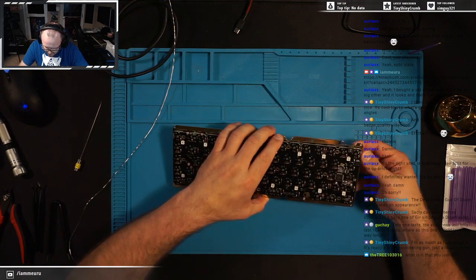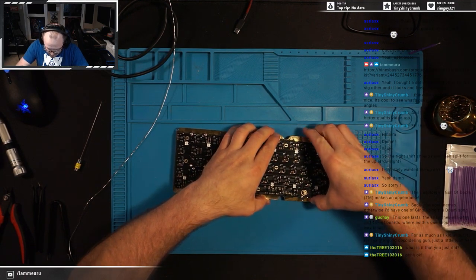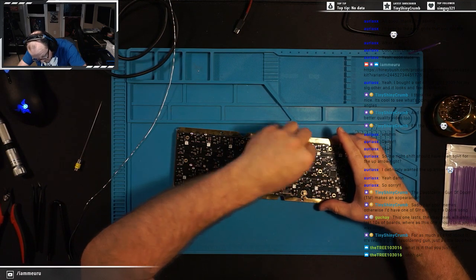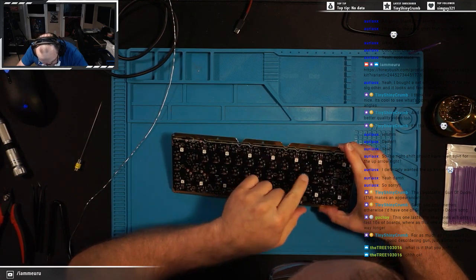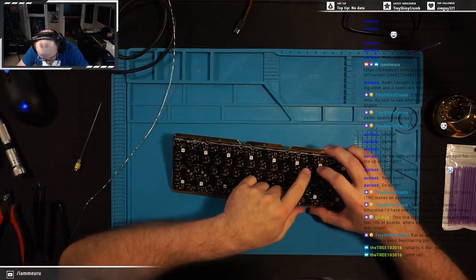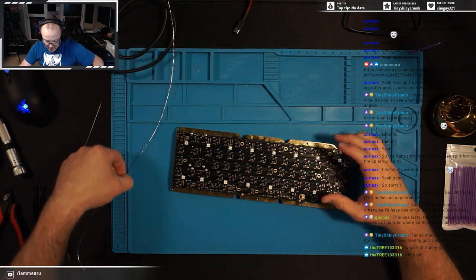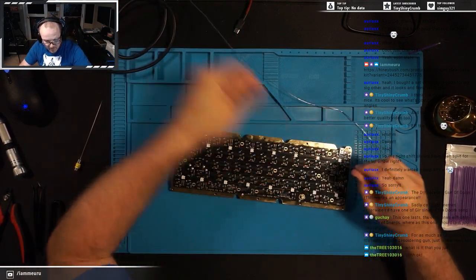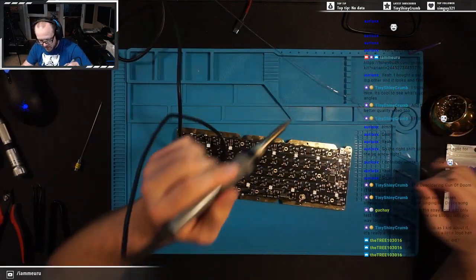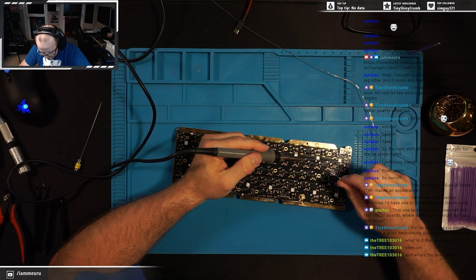Like, that's not a thing you want, right? So like I can lift up on this. There's a lot more friction on this board already, and that is one reason why. That E-hole. So even though it moves, there's actually some solder still in that hole. So what we're going to do is we're going to add solder so that this desolder gun can reflow that well.